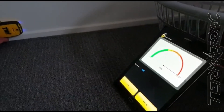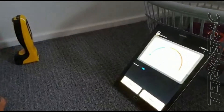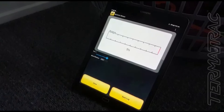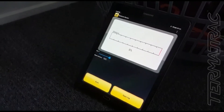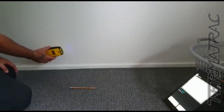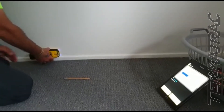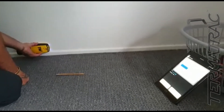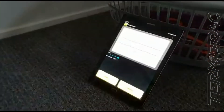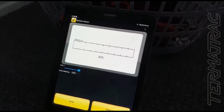What we have to do now is flick over to the relative meter. To do that: direct moisture on/off. We're now on relative — this is what we're going to use to pinpoint the extremities of the moist area. I'll go back to the center of the wall where I had that moisture and hold the unit on the wall anywhere in this white box. I've now referenced it to that wall area's moisture, my moisture, and the humidity of the day.